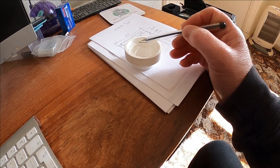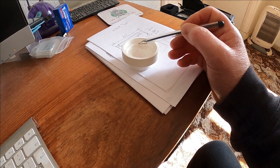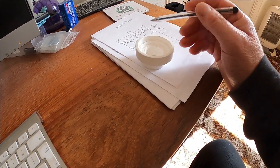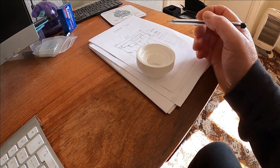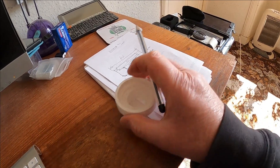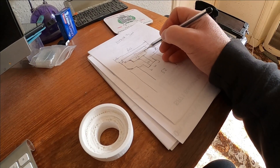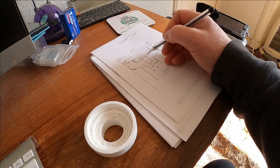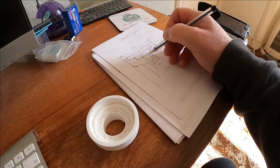You can see where that 2mm chamfer was - it seems to print okay. So if I come down at about 45 degrees down to there, we should be okay. I'll modify the file - on this drawing it will just be a half mil step there and then just taper the whole thing down to 28mm.